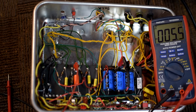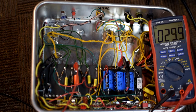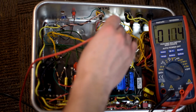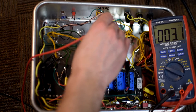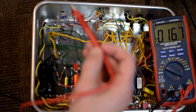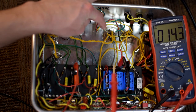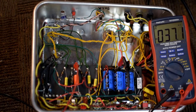To make things work. And to that end as well, you want to be very careful when you're using these pointed leads as far as what you're touching. Especially on these tube sockets, I've had it in the past where I'm trying to touch one tube socket pin and maybe I'm a little shaky and I slip a little bit, and I touch maybe the body of my lead on one tube socket pin and then the tip touches another, and that bridges two connection points that should not be.